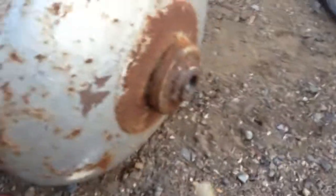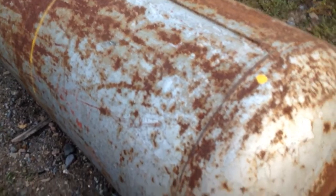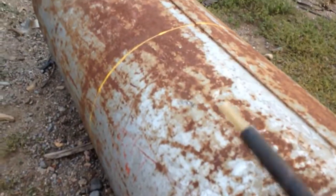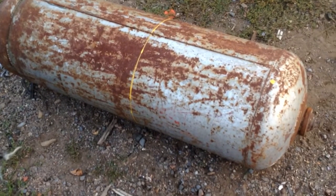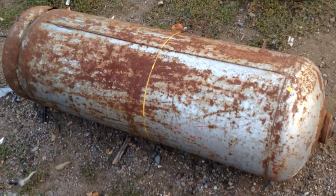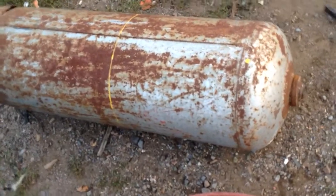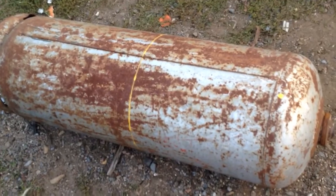You can fill these tanks up with water to displace all of whatever might be in there — air, propane, or whatever. But since this one has been open for years, I'm just going to stick a hose in there and blow it out. I don't think there's any explosive gas in there. If it was a recently used tank, I'd probably fill it up with water to completely displace everything inside. After you fill it up with water, turn it upside down and drain the water out, then you can go ahead and cut into it. Most of these old recycled tanks are going to be empty anyway, but you want to make absolutely sure.